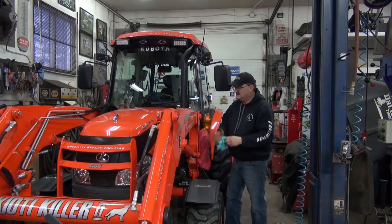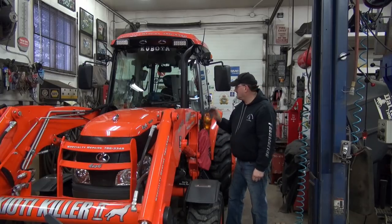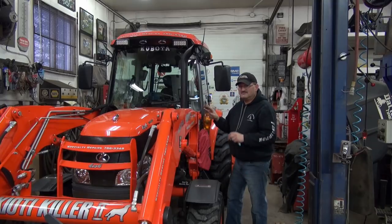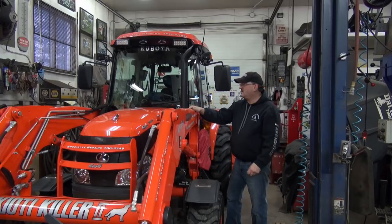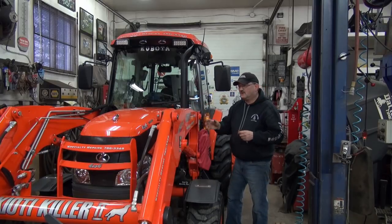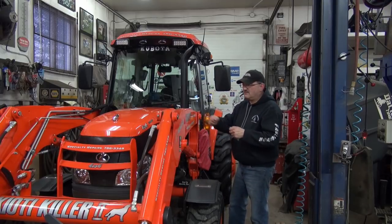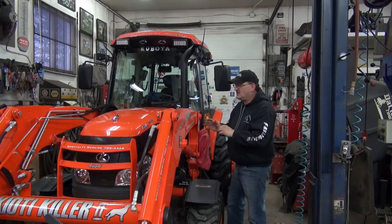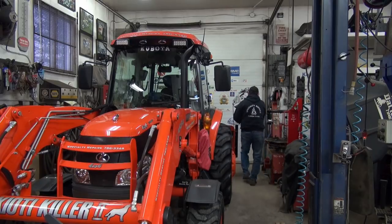There you have it, guys. That's a take. I started at 10 o'clock this morning, took an hour break, and it's 5:45 in the evening. But I did the fire extinguisher, and I did it right, in my opinion. Everything is heat shrinked and soldered, and put in a wire loom. It's all put in a harness, all electrical tie wrapped up, and there's nothing it can touch. If it passes through the cab, there's a grommet there. Hang on a second, guys, it turns off the compressor.